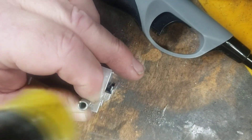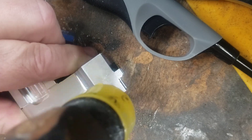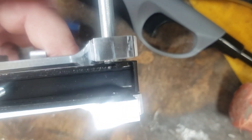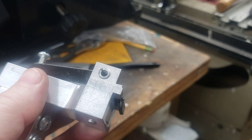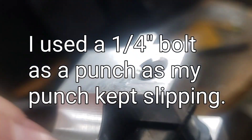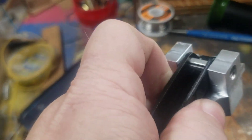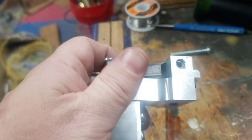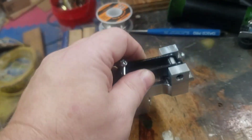Now, unlike the wheel, you can just hammer the roll pin straight in. We're just going to drive this through until the pin is all the way through — don't come out the other side, but get as close as you can. The roll pin is in. You can drive that roll pin to be a little more centered — probably not a bad idea. We've got a little bit of a recess on both sides, roughly equidistant. It's not that critical, but everything is captured in here and it's all straight.